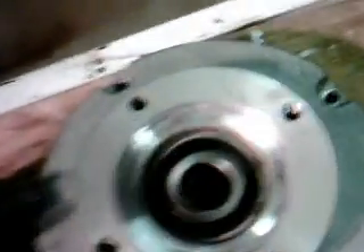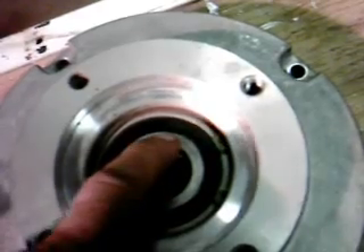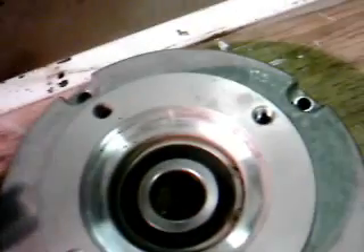There's only a couple of them — that one right there, this is the worst one, there's another one there. And that's the bearing I have to change. But if you look it looks pretty thick right through here, so I think they make another bearing that's oversized, probably a quarter inch bigger than that one. I don't think I'll have to machine this out like I thought I was going to.